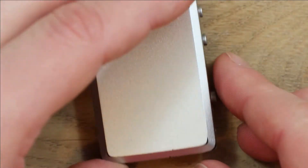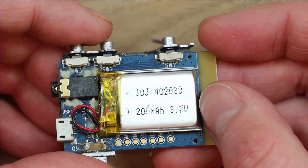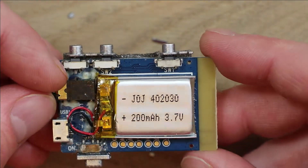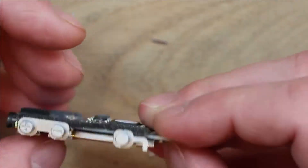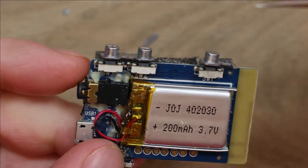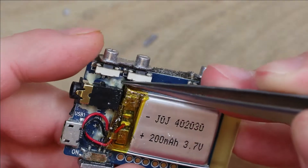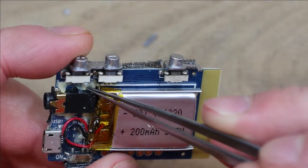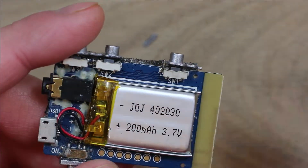Let's get this board out. On the back we've got a little rechargeable battery — 200 milliamp. There's quite a bit of space in here actually; I'm surprised they couldn't fit a bigger battery. It looks like some sticky-back foam there — I'm not quite sure why they've used the foam, maybe that stops it rattling around. I've also noticed down here it looks like they've put glue around the headphone jack — I don't know if that's an attempt to give it some additional physical strength onto the board. You'd normally just put bigger pads on the PCB and a good dollop of solder, but I'm not quite sure why they've gone about it that way.